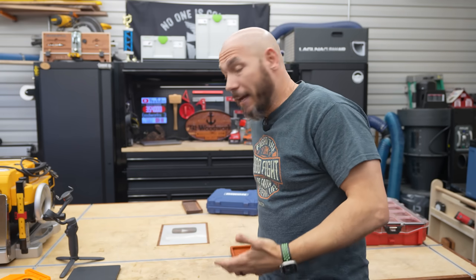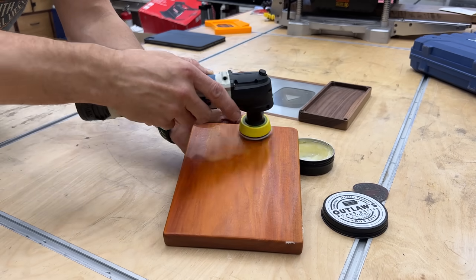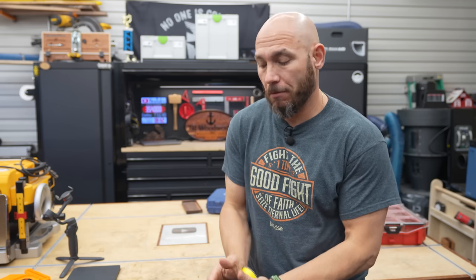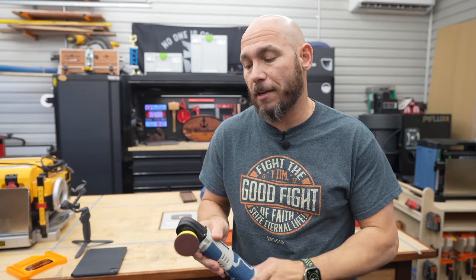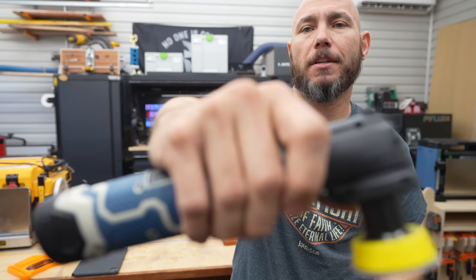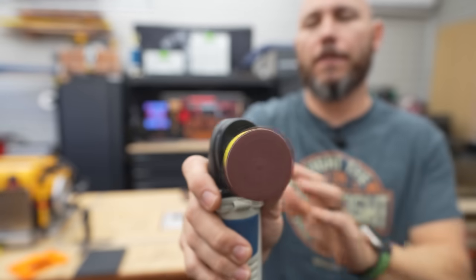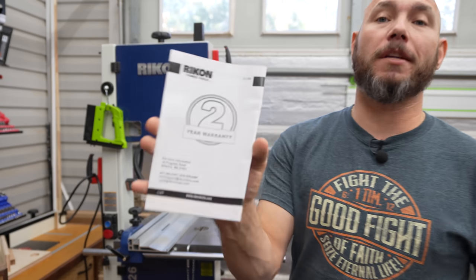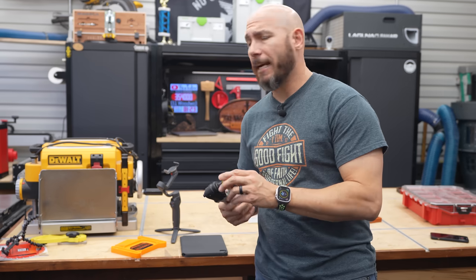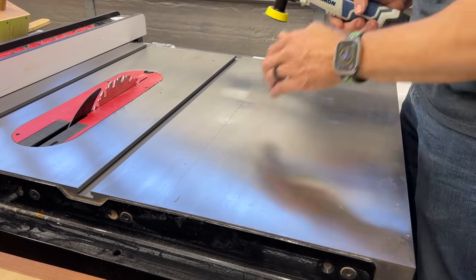There are a few more uses around the house: it's a polisher. You get that polishing pad and can use it for epoxy resin, old headlights that need polishing, polishing chrome — anything you need to polish, including your boots. Another thing to note is that because it's not a random orbit sander — it's just spinning — there's minimal vibration, so it's not going to fatigue your hand. It's seriously just a spinning motion. As far as Rikon tools go, I've had their bandsaw for quite a while and I've been nothing short of impressed. The detail sander also comes with a two-year warranty, which is pretty good. I can also see this being used to get rust off of tool tabletops, table saw surfaces, things like that, with a high-grit sandpaper — key to keeping those elbows ungreased.